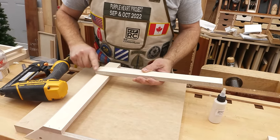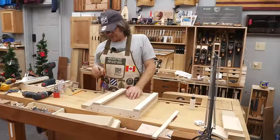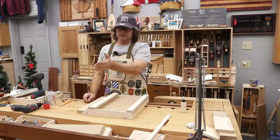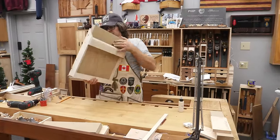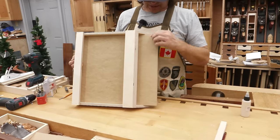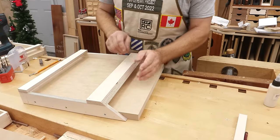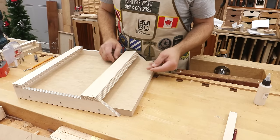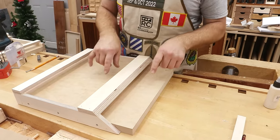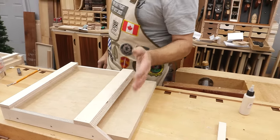There's no great amount of force on this piece so a couple of nails and glue will be sufficient. Now the glue is dry. I want to go over and dial in my fence. I'm going to move my fence to the left side of the blade because my blade tilts away from the fence. I'll turn this over and cut a 45 that trims it flush and cuts down into the MDF — that's what the plane is going to ride on. I need this to be as close to 45 degrees as possible, so I'm going to get a piece of one inch MDF and check my blade with a protractor.